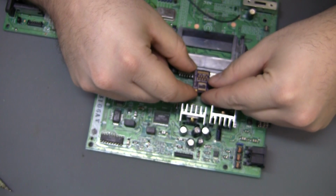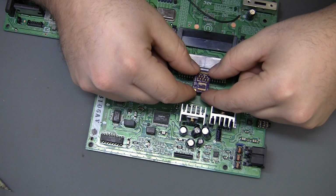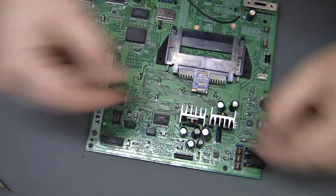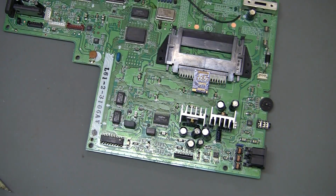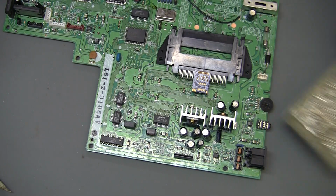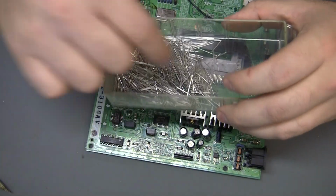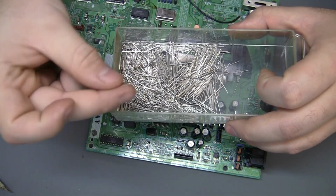And basically the circuit board is just going to fit right down onto those pins. Wiggle them in there like that, and they're all sticking through, and they'll be easy to solder to. And then comes a part where some people might have a little trouble with this. You've seen me pull this out several times, but this is just capacitors and resistors, the legs, the through-hole kind of components. You know, you cut the excess off, that's what you're left with.